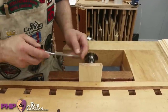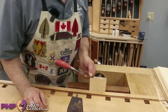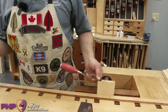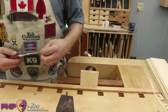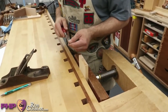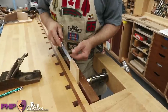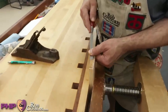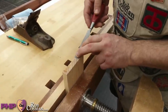To control that, if you flip it around and have the bevel on the wood, that acts as a great point of leverage. So with the bevel down, you can lever against that crest right there, and if you need to adjust, you can just pull down a little bit or raise up and you've got a lot more control. If you want lots of leverage, you're going to have the bevel down and you can control your depth of cut. If you're trying to get something perfectly flushed off — like flushing a wooden peg — you'd be better off laying the chisel flat with the back down.